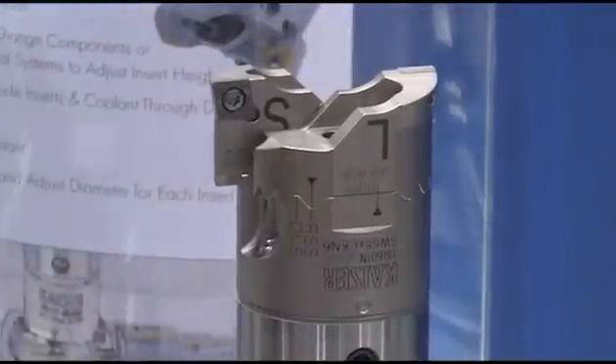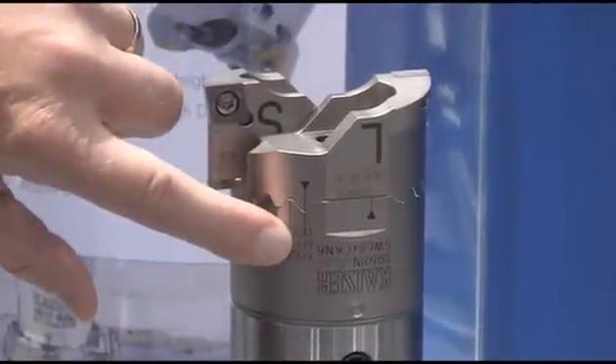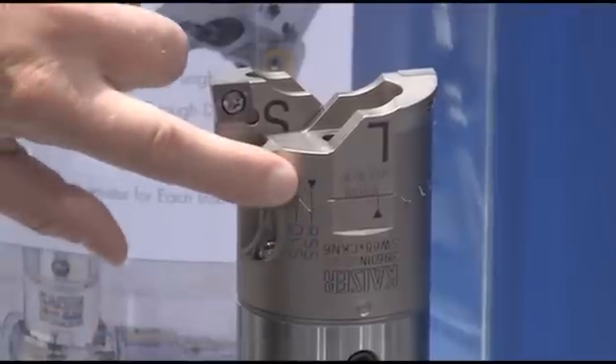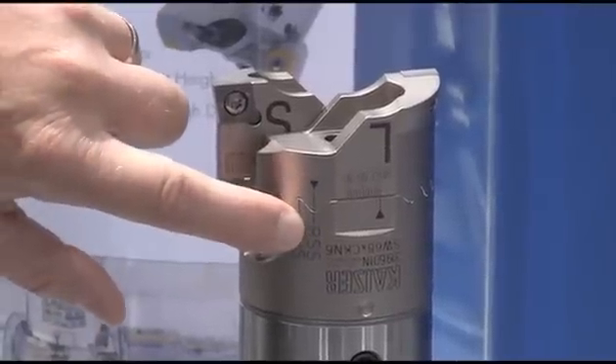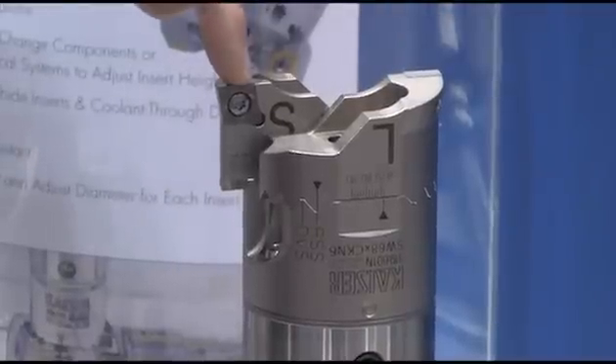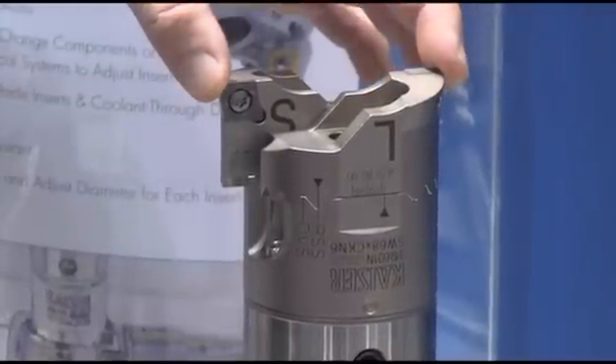Assembling these tools gives you a clearly defined direction as to what you have. RSS means balance cutting, and if the arrow is lined up to the RSS value, you have that on both sides. These two tools are now on the same height and will be preset to the same diameter.